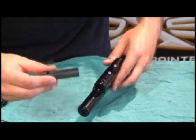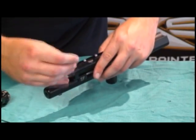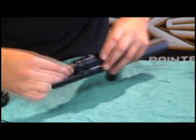I'm going to put the bolt in next. If you use any lubricant, only one style of lubricant. Triflow. It's the only thing that doesn't expand Delrin, okay? Oh, actually, I need to time this first. So I'm going to get the bolt out.